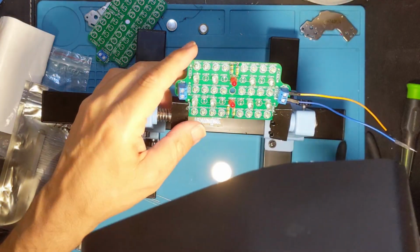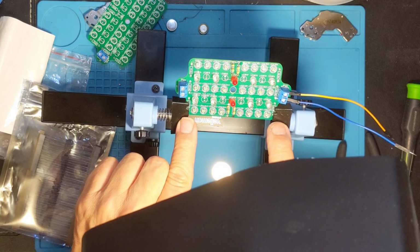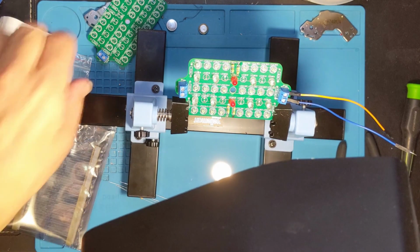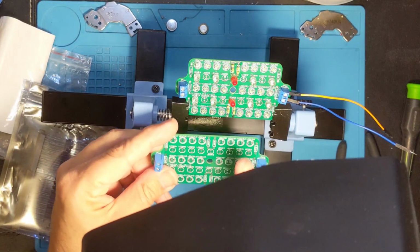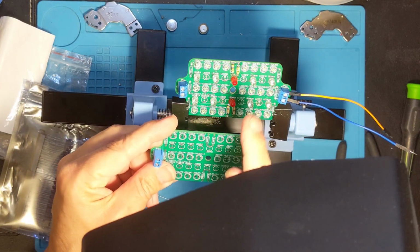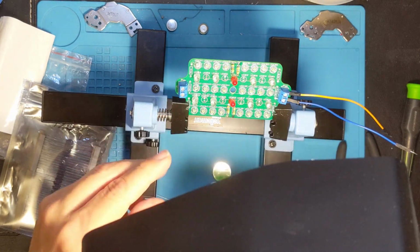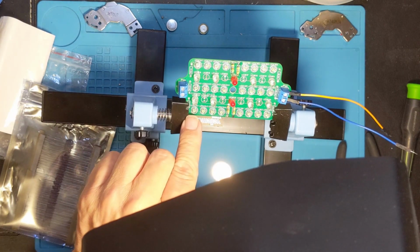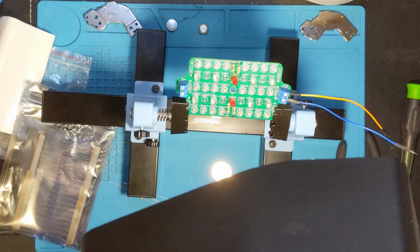So that leaves us with putting in the resistors now for the white. So I'm going to start putting those in. Actually, before I do that, since I've already got the materials out, I'm going to put the resistors and the LED, the red LEDs for the infrared on the new one. So I'll get that, and then I'll come back when I've got the resistors in here for the white LEDs, at least the first couple, so you can see that light up.